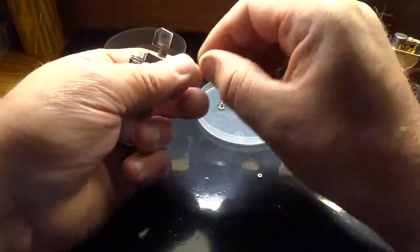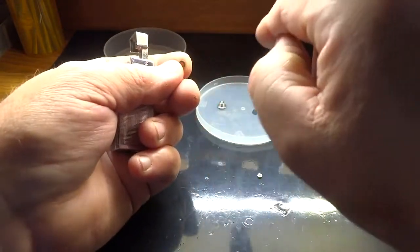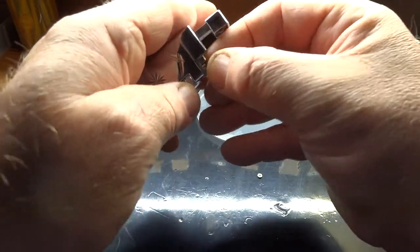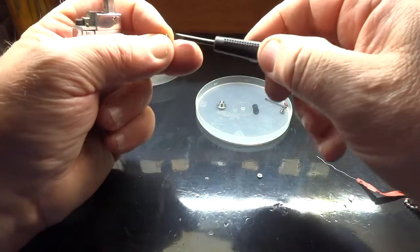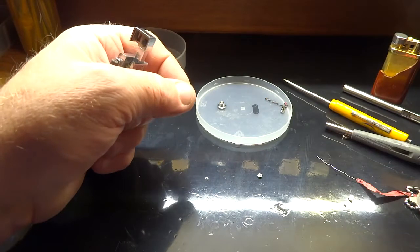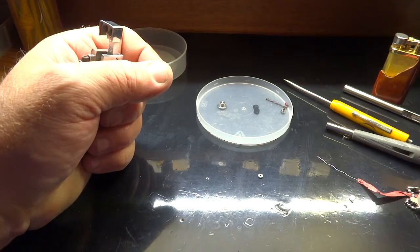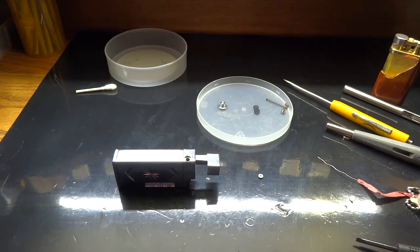Alright, now when you put these flint wheels back on here, they're going to be angled. You want the little points on it angled clockwise. That way you can slip that back on there like that. Alright. Takes a minimal amount of good tools to... tell you what, that about ended up on the floor. Yes, it did. Let me get my... right here under my camera mount. There we go.